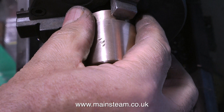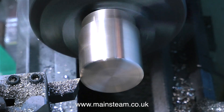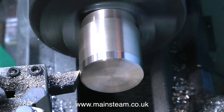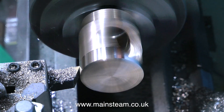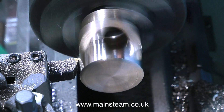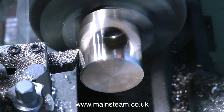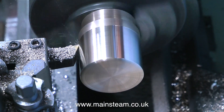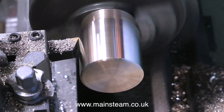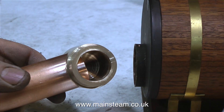These marks that you can see were caused by the jaws of the four-jaw chuck during the boring operation. I didn't bother packing the jaws because I knew I was going to do this right at the end. And now I'm taking a very fine finishing cut down the entire length of this machined piece of flue tube. It will fit the boiler perfectly, and there will be no marks whatsoever. And now when I temporarily assemble the part, it looks good — far better than a piece of plumbing.